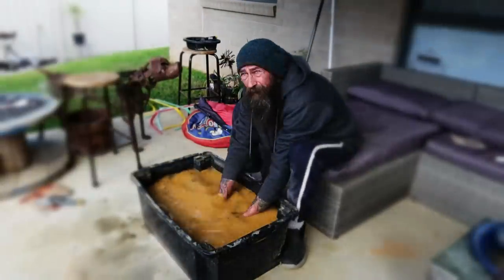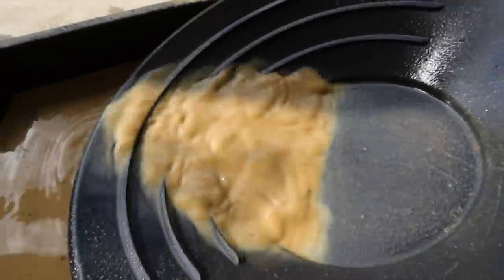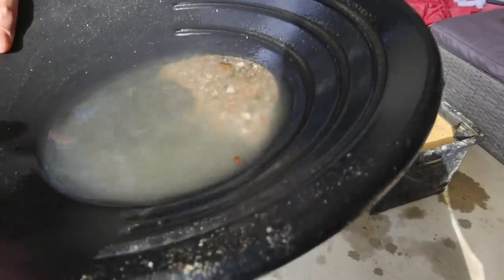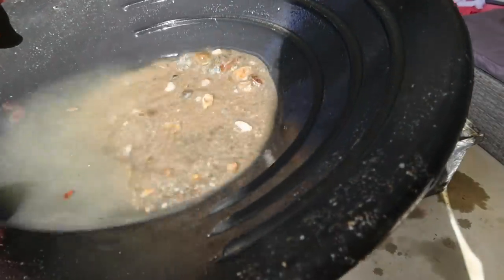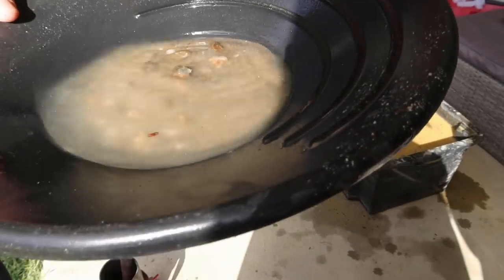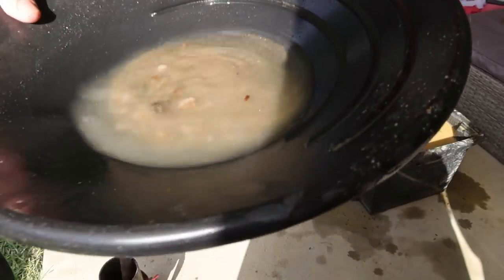We did a total of about half a bucket's worth of ore crushed, and these are our final concentrates. Clean water helps - it's hard to see yellow gold through yellow mud. The gold you're going to see is going to be extremely fine; this is why we have to run this again. We're not going to be doing that today - we just want to see what kind of gold is in that ore. We could probably safely say we could double our gold take by re-crushing it in the ball mill.